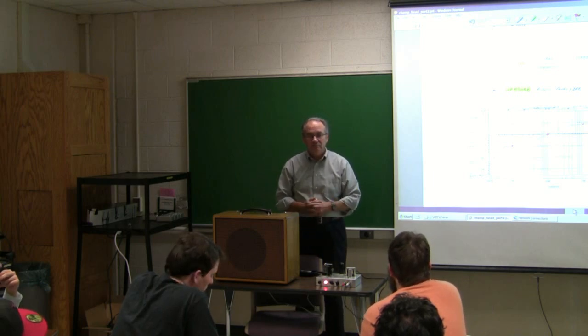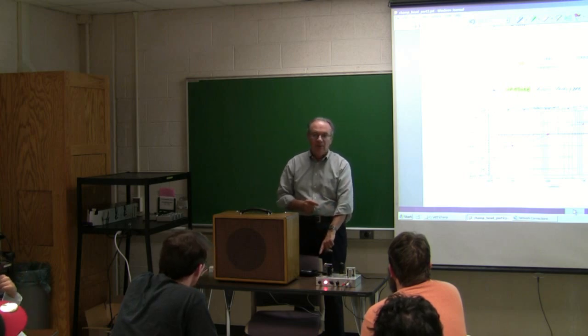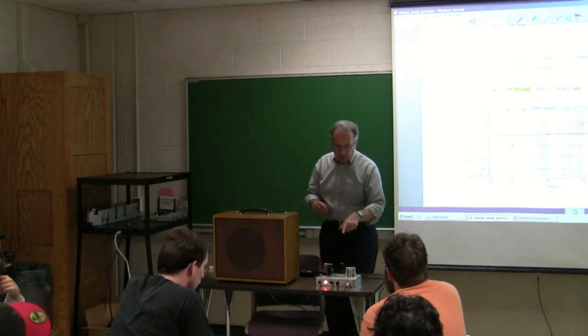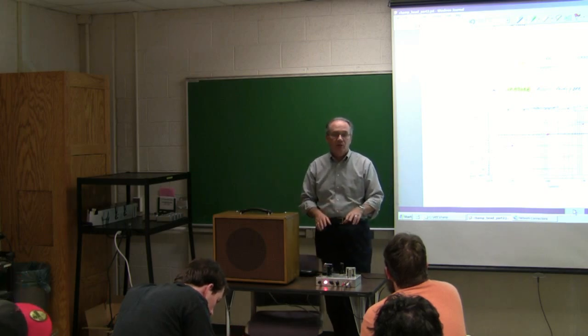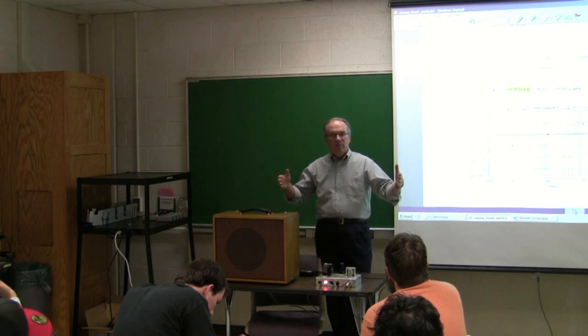I'm just trying to think about if you were to totally take that whole tone aspect out of the circuit, would it be how it sounds? Would it be the volume it was when you had the tone cranked all the way this way, except that it would be flat? I didn't crank it all the way up because I got the CD player on minimum, right? And so it was still kind of loud. But I mean just the tone now. Like when you had it all the way to one side, it was very high pitched. Yeah, it would be. Well, it's like in the sort of the middle position. You pretty much have somewhat of a flat response. Right. So you get almost as if there was no tone control at all. So you could, if you didn't want a tone control when you're playing, just leave it in the center position roughly. And then you play with the volume, and pretty much you get a wide bandwidth result.